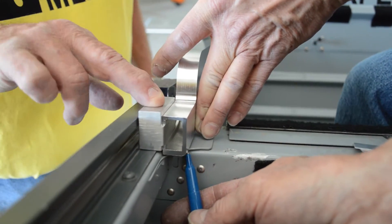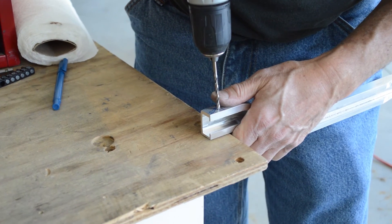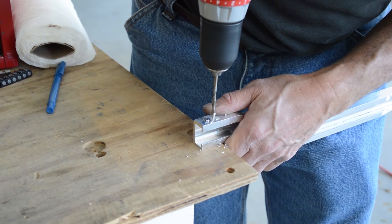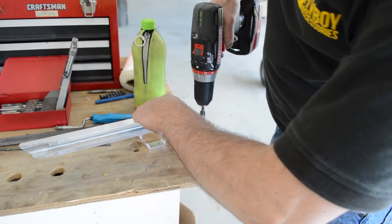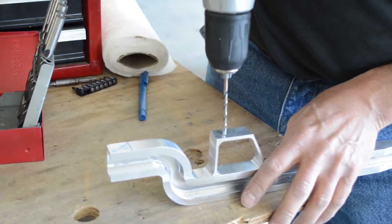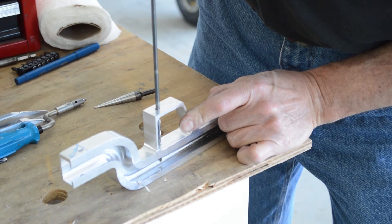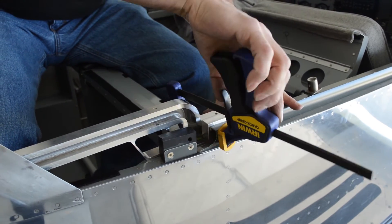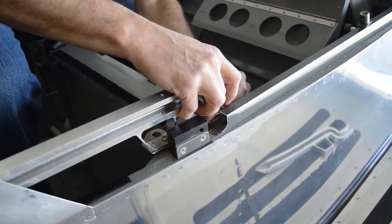Now it's time to plan where to put the screws in the S-Tracks. Refer to the instructions for some notes on screw placement. When you're drilling these holes, you'll need to countersink any screw holes that are inside the track. To do this, drill the screw hole through the bottom in the proper placement, then continue this hole through the top of the track. Enlarge the top hole to a size that will accommodate a countersinking tool and countersink for one of the number 8 countersink screws included in the kit. When you drill the hole for the trigger guard area, we recommend that you use a long bit to drill all the way through the track — this will help you in drilling down for the proper placement. Put the S-Track in place using the spacer block, check the fit again, clamp and drill the holes you will need. Place the screws and hardware and check the fit and function one more time.